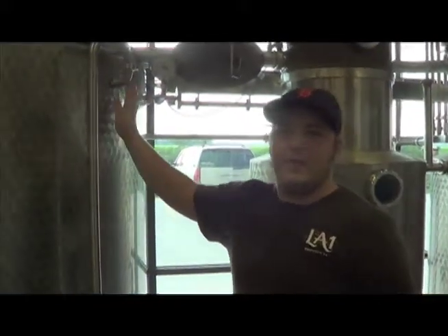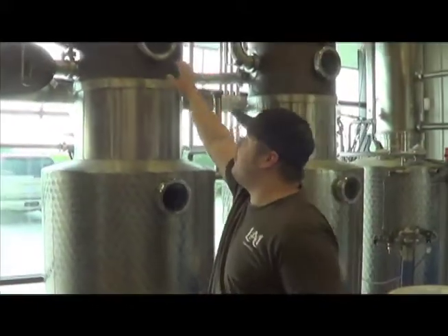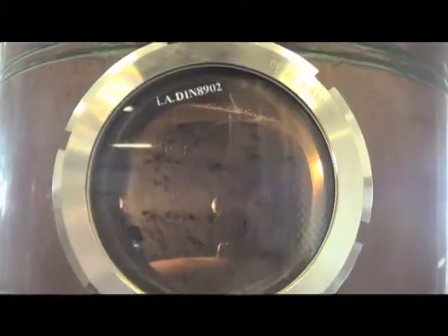Basically what's going on in here is we'll make a wash, or technically kind of a beer. It starts up around 8 to 10% alcohol. We're trying to evaporate that through heat. Alcohol evaporates faster than water does, so it starts heating up at 179 degrees Fahrenheit as a gas. As it passes through each one of these windows, it collects as a gas and goes up through a perforated cap.